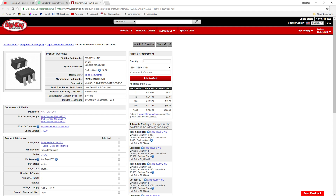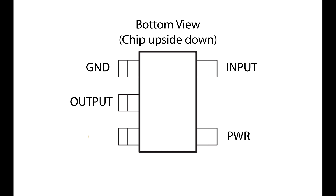This is the signal inverter chip that we're going to put on there — basically remove the one that's there and solder to this one. This is from DigiKey, I'll put some links in. Looking at the chip from the underside with the pins angled up towards us: top left is ground, middle is output, bottom right is power. These are the coloured wires I'm going to solder to it — black to ground, red to power, blue to output, and white to input.